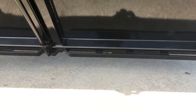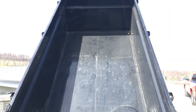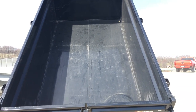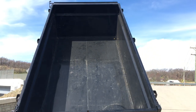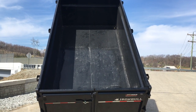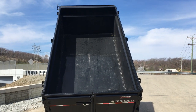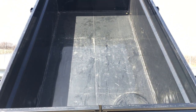The ramps are fully adjustable — you can get almost full adjustment out of them. They do a 10-gauge sidewall and floor, so from the top of the wall to the center of the floor it's all one piece. This being a high side, of course, they do them a little bit differently. One thing important to note: they run their seams parallel to the trailer, not perpendicular. From trade-ins over the years, we've observed that the ones running parallel seem to stay a little bit less warped over time — that's an observation from probably 50 to 100 dumps traded in over the years. This 10-gauge is pretty well industry standard; some use an 11, and very occasionally we have a manufacturer that uses 7-gauge.